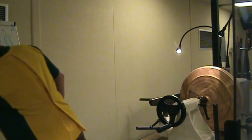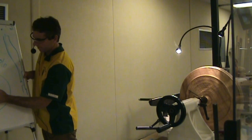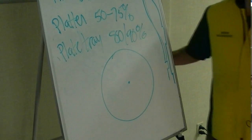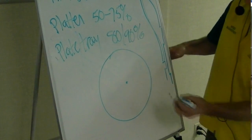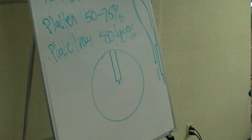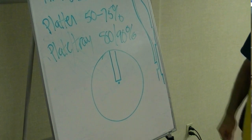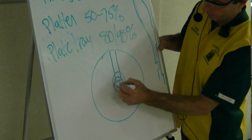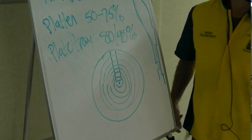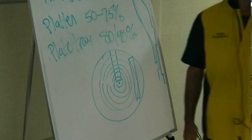Why? So we're out cutting there in the field, and if I'm making platters, I'm making platters out of the tree that came out just like this. There's my platter blank right there. You can see that was a fairly large tree. Because the annual rings are going through that board in a straight line. So if you make your platter blank over here, your rings are really long sloping arcs.